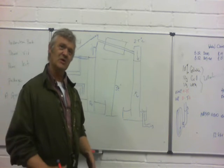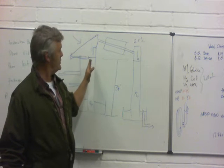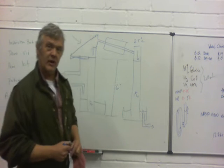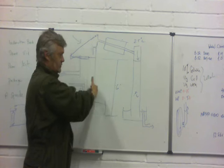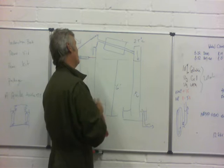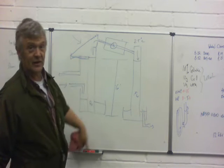Trying to get a column like that into a smaller unit creates a lot of problems. One thought I had was that instead of using full barometric pressure to hold the column, we reduce the column height — instead of 34 feet high, we want it at around six feet high. Then we equally need to reduce the pressure over that part of it so that it still drops down to create that situation. So what we do is put a pump in here so that the pump will take the water vapour through, maintain the actual difference in pressure, and incidentally remove the gases.